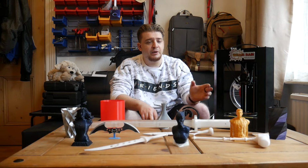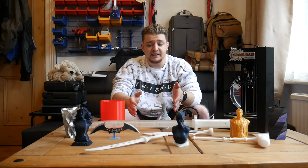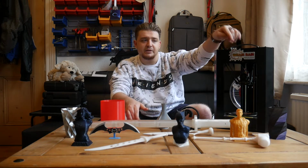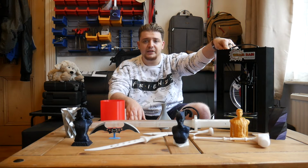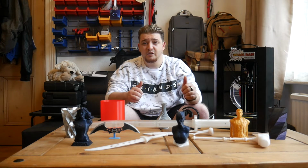This printer is fast. When compared to the Prima Creator P120, which is based off the Monoprice Maker Select Mini, a similar style printer that is Cartesian, if I had the same print, say a Benchy, printing at 50mm per second on both of them, this would finish first, because Delta printers can accelerate and decelerate much quicker with less jerk, so the print result doesn't suffer as much.